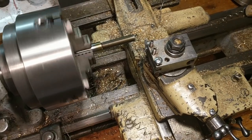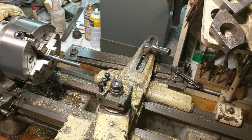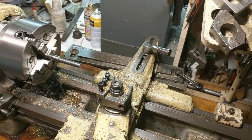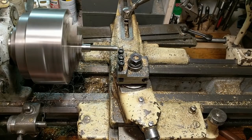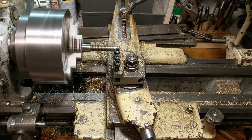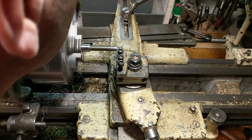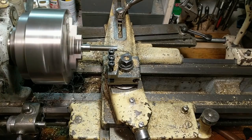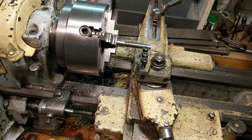This will be the final pass. I just measured with the thread wires and we were within five thousandths — I actually want this to be slightly oversized because I don't want to cut a real tight joint. The threads are now cut. I've set up the taper attachment to cut a very strong taper — I'm not even sure what taper, I just know it's cranked way over towards the limits of what it can cut. I have a carbide cutting tool in there. There is a nice, fairly sudden taper — a real gentle taper could have been called for if I was making this from scratch, but in this case I'm just making it to clean up.